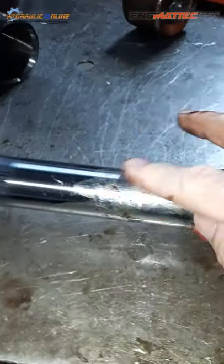Because we're only doing a light polish, and I have three teeth of my jaw gripping onto the gland nut, I can chuck it in as it is. All right, so what sort of speed are you running on the lathe, after you start? Okay. So looking a lot better. There's a lot of corrosion in those grooves, and we need to polish it out.